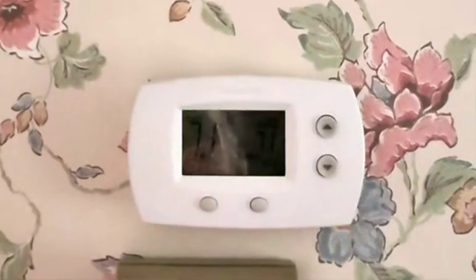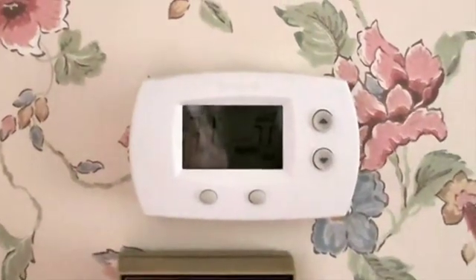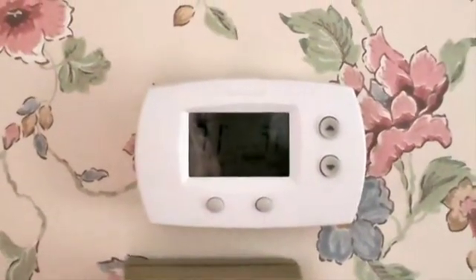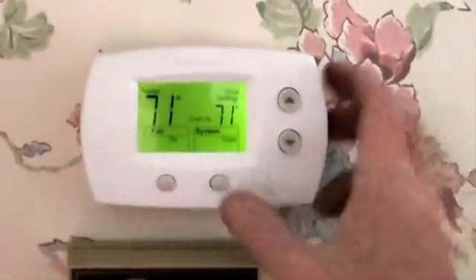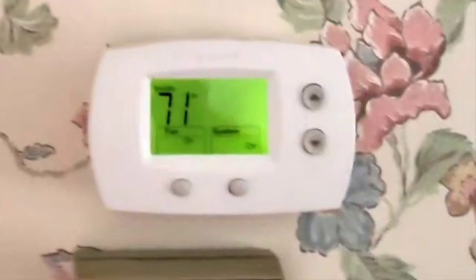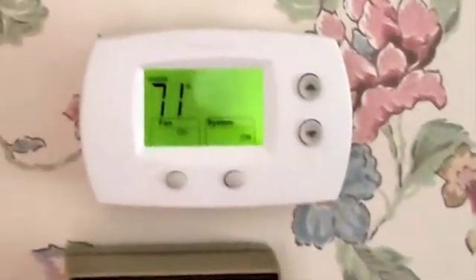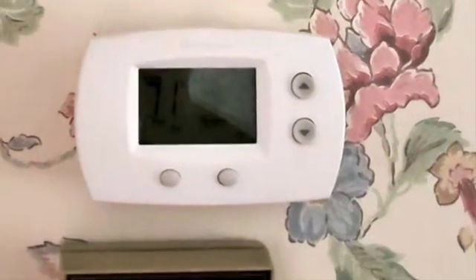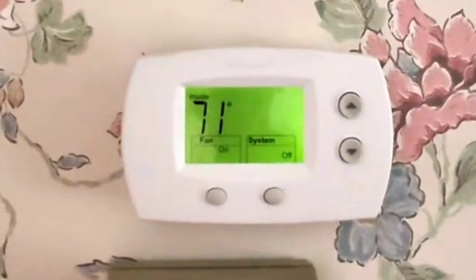I'm about ready to switch over my solenoid from a 240 volt to a 24 volt that is run off the thermostat here. But the first thing we do before we start messing with that is we're going to turn this system off, because we don't want it sending a signal out there while we're trying to wire that up. It's 24 volts — it'll give you a little bit of a jump. So we want to make sure that doesn't happen. Let's head out to the unit and I will show you how we wire that up.